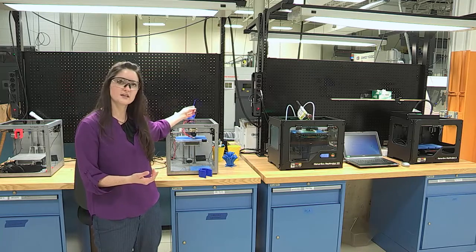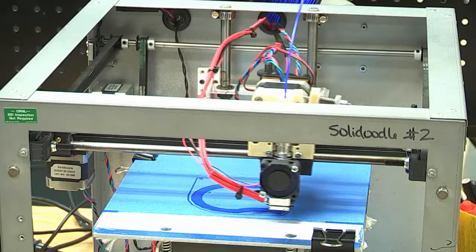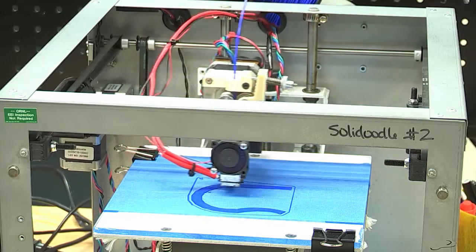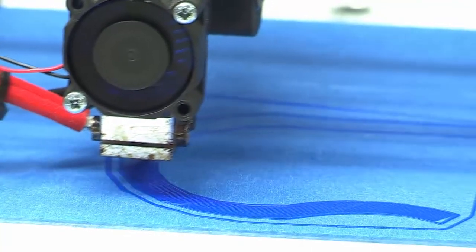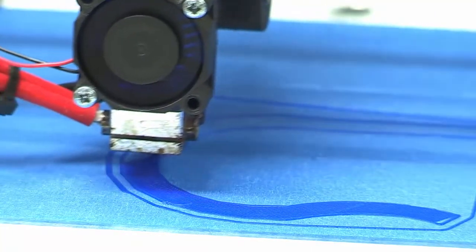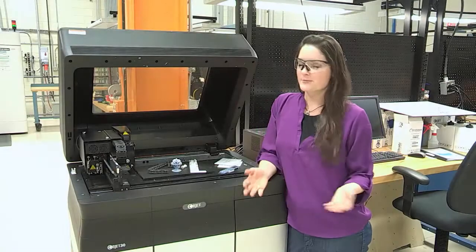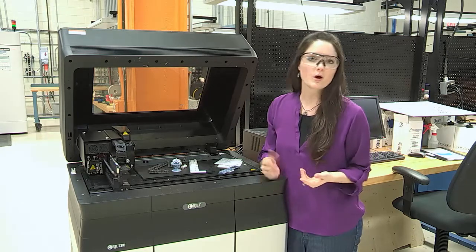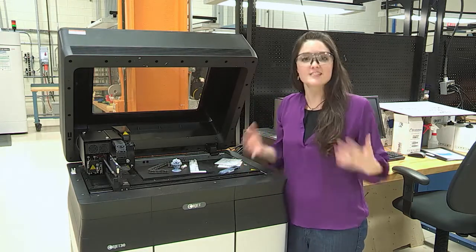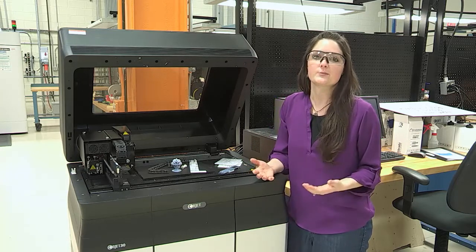This is just plain old FDM technology. We take a string of plastic and it gets driven into a hot nozzle with some drive gears. That hot nozzle squirts out molten plastic and draws the shape of each layer — just like a little tiny hot glue gun putting down traces of material. That's how we build the object layer by layer. The most important thing to remember about additive manufacturing or 3D printing is that there's more than one way to do it. In fact, there are about seven different technologies commercially available to actually 3D print something.